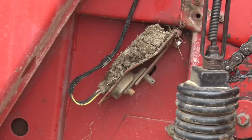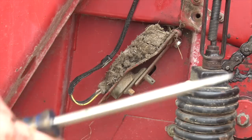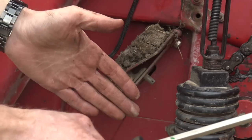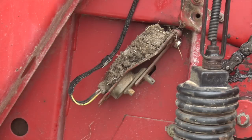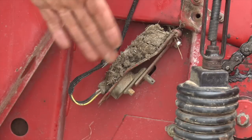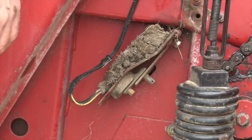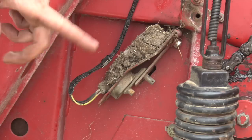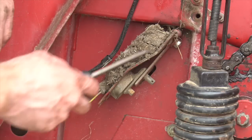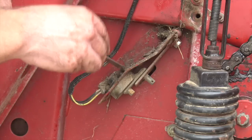Other than the various missing parts on this baler, the biggest negative surprise seems to be these sensors. There's one on each side of the machine — if you have a lopsided bale, it registers more on one side than the other because there's a little arm that actuates a potentiometer. They both seem to be working electrically, however they're both stuck — nothing moves. Looks like they haven't moved in quite a while. I did the one on the other side; that took probably three or four hours by the time I figured out how it worked, took it apart, cleaned it, and put it back together.